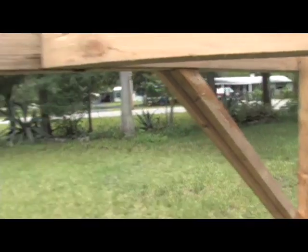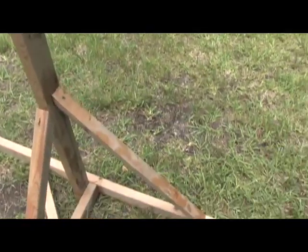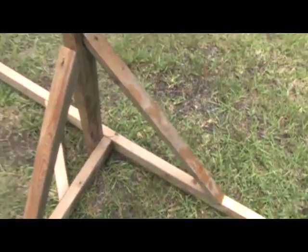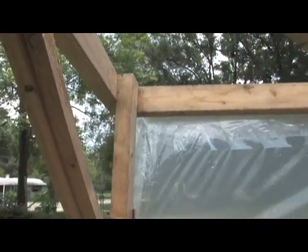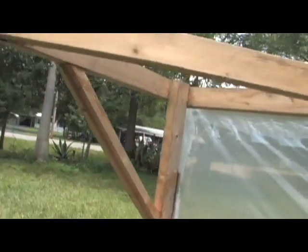One simple thing you can do when you construct something is add braces like this. These braces add a ton of stability — you can move this around like nothing without them. What I did was I took these vertical braces off so we could have a nice square, and you can see how it starts to flex — that's not good. When those braces are in, that won't happen. We put this on pretty much everything we have that stands; they really help out a lot and give it tons of strength.